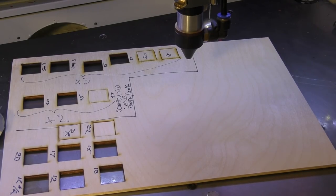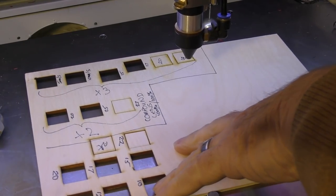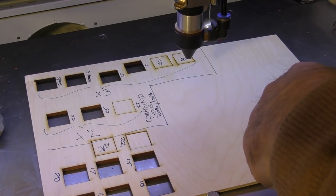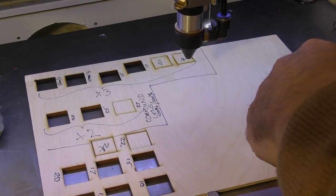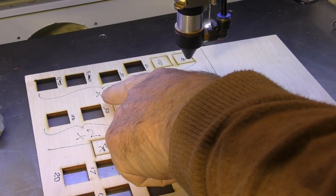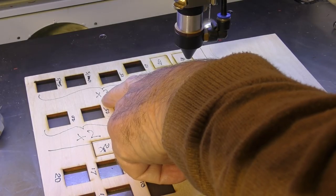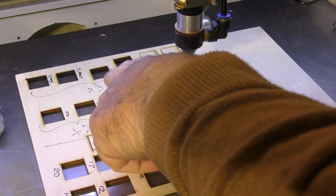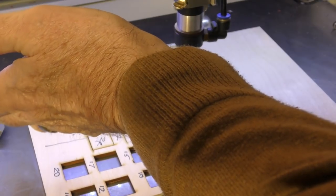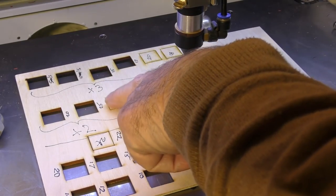We started off with a boring bit about PWM, but the case is proven, so we can leave that behind us now. I have to say, I was pretty surprised about the cutting capability of this machine with 20 watts. I thought I was only going to be able to cut tissue paper, but 3 millimetre plywood has been a surprise to me. With the compound engraving lens, we were able to get up to 17 millimetres a second with a 3x beam expander. All I can say is to those people that thought I was being mad when I changed to a 2x beam expander, what do you think now? My case is proven. I can do 17 millimetres a second with a 3x and 25 millimetres a second with a 2x.